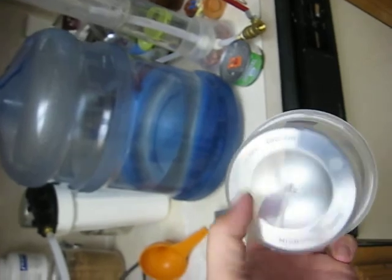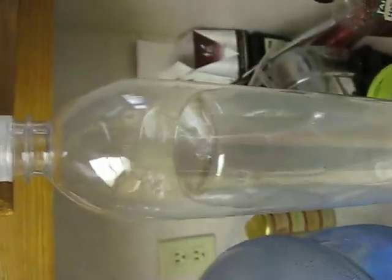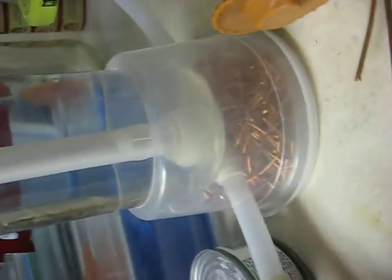I used a drafting divider to cut the hole in the bottom of it — just went around and around — so we got a nice neat hole, just the size we needed for our extremely high-tech HHO meter. And the slip-in fittings in the bottom seem to work pretty good; they get a pretty good seal and they're really handy for taking things apart when you need to.